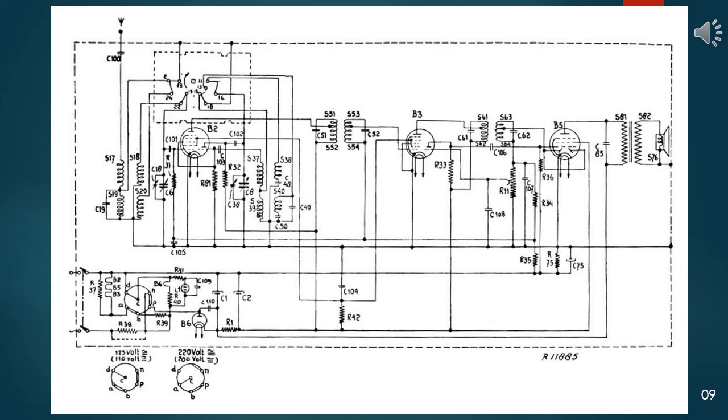While cheap AC/DC radios had been made in the USA since about 1932, Philips did not manufacture a really compact AC/DC receiver until this Philetta model of 1941, designed around their first series of 8-pin Loctal-style tubes designed for home broadcast receivers. This type of tube construction scheme was first employed by Philips in the circa 1939 type EF50 9-pin tube. For military high-frequency applications and television, this proved to be one of the most useful tubes in the early war years.